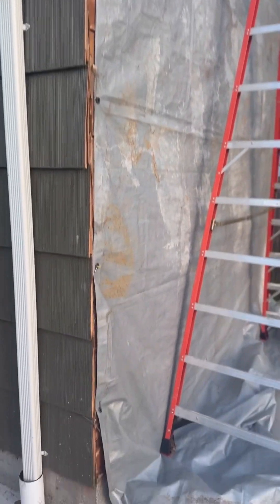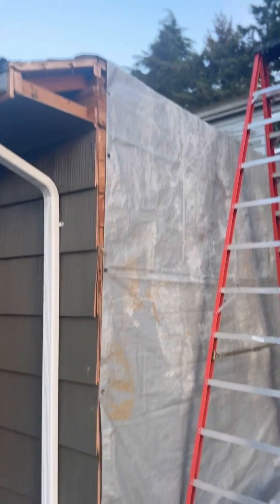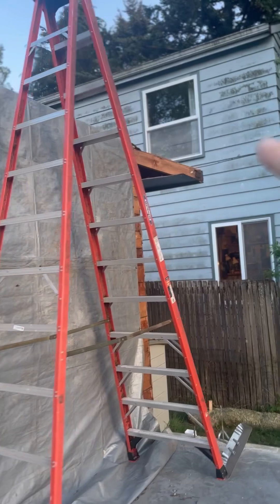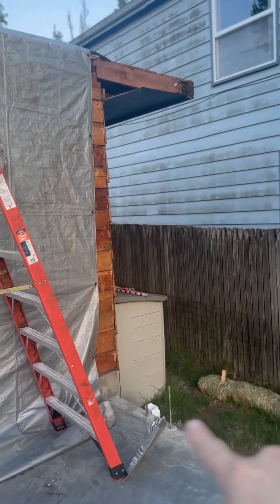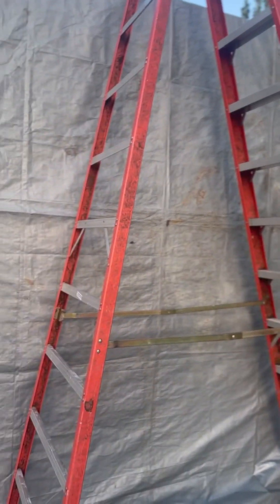The other big thing that's been done is taking off all the siding, going back to the shiplap on the back, and cutting the roof flush. You can see why it's tarped — the shiplap has pretty open seams so there's basically a lattice from the inside of the shop. They cut the roof flush and will cap this gutter. The gutter on the back side will be capped and they'll run a new one, with the front gutter combining the roof line over this part of the shop with gutters from the other half.